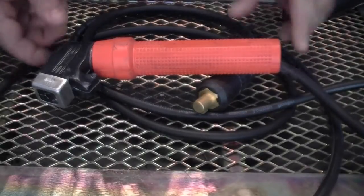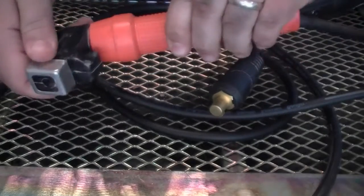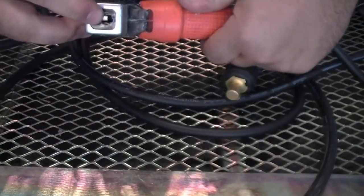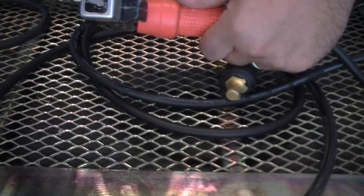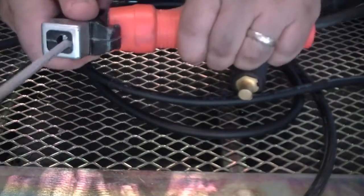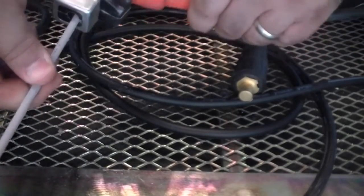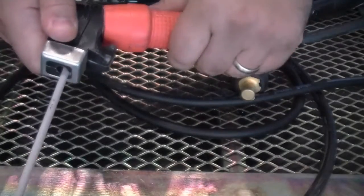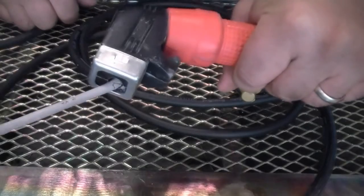The stub type holder is common on pipelines and for advanced welders who enjoy the sure grip of the holder. You can see that the unit has a jaw inside the opening which, when the head is screwed down clockwise, tightens firmly on the electrode. When adjusted, you only need to turn it about a quarter turn or less to tighten or loosen the electrode to change it out. If you want to change the angle of the electrode, simply bend the rod to the direction you want and it'll work just fine.